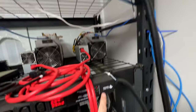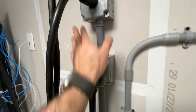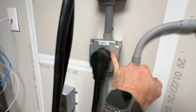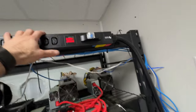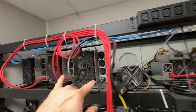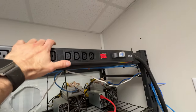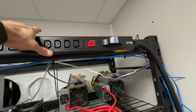It's the same brand PDU as I use with the 30s. The only problem is it gets kind of warm — that's not uncommon, the plugs get warm because the most resistance is right where the plug contacts the receptacle. But this plug gets a lot warmer now because it's pulling a lot more amps. It's a 50 amp PDU and I've got these three miners on it. Previously I had an S21, two S19s, two L3s and something else — it was about 36 amps.